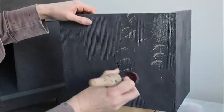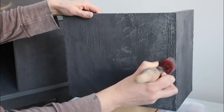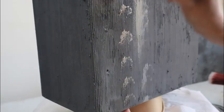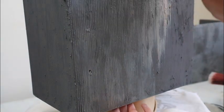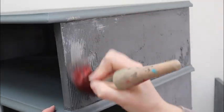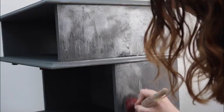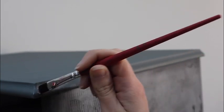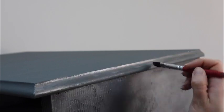To give it that shiny metallic element, I used two different metallic paints. Steel Magnolia is more of a duller silvery gray — I did two tests with this: one door in a speckled pattern and the other in straight lines down, and in the end I chose the dabbed-on effect as it created more of a splotchy, weathered look. I then added highlights with another metallic paint called Silver Bullet. I anticipated adding low lights with black as well, but there was already so much going on that I felt I didn't need that. I didn't add ridges to the top of the TV cabinet since a flat surface is more practical for drinks and snacks, but I followed the same color pattern without the texture underneath.